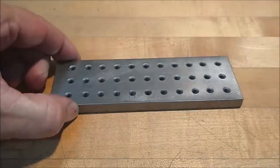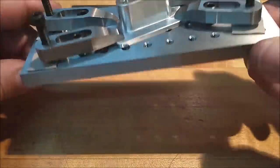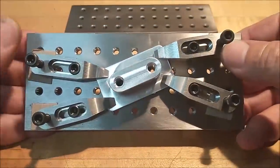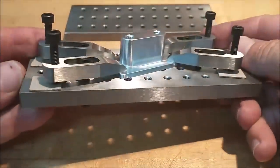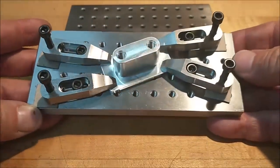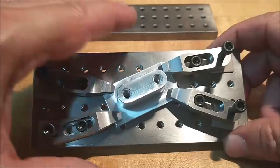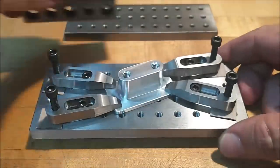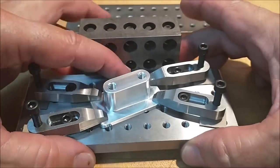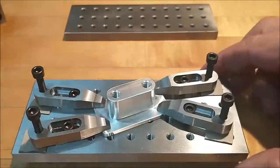In keeping with the times I had to upgrade this, and this is the upgrade right there — there are considerably more holes in this. The clamps are A2 tool steel and the plate itself is precision ground low carbon material, six inches long. If you have a six inch vise, great, it fits perfectly. If you're wondering how to put your piece on there at an angle with no pin holes, sit it down inside the vise jaw and clamp it closed. You can put your angle block or parallel back in the vise jaw, clamp your part, and then move the piece up — boom, done.